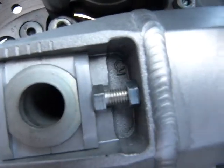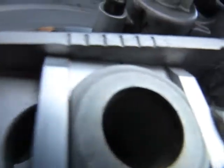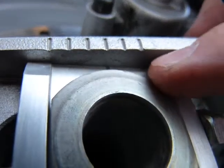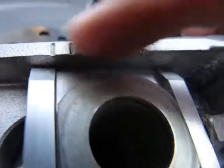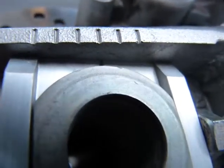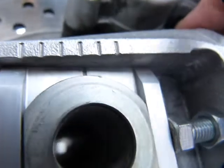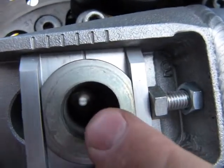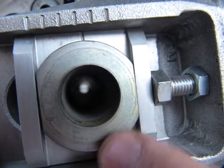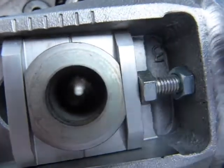So this is parallax error. The distance here is not between the needle and the instrument panel — there is no instrument panel and there is no needle. The difference is between the face of this square washer there and the edge of this metal piece here. Because these two are not flush, this scale is not flush with that mark. That's why parallax error exists. You have to make sure that your eye lines up with the exact center of the axle, and that's when you read it.